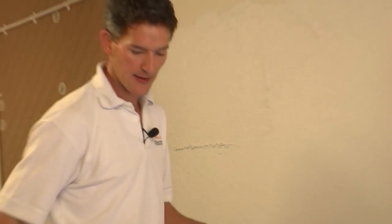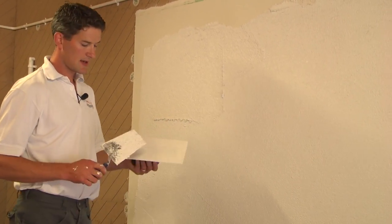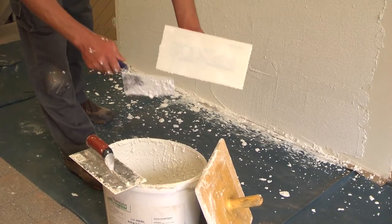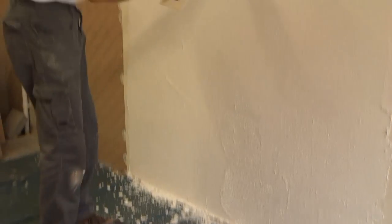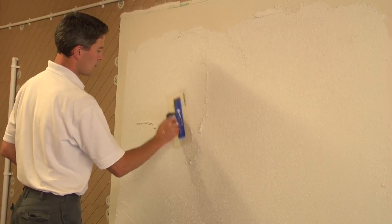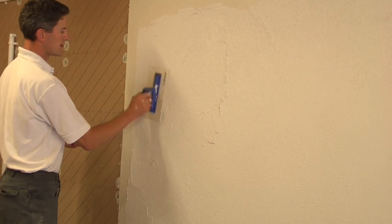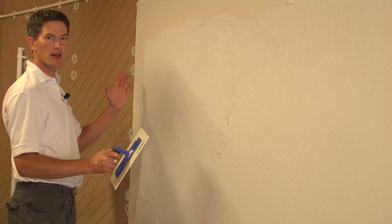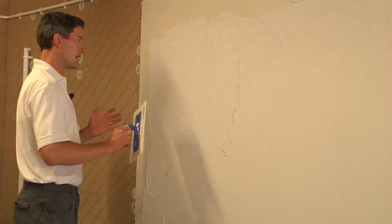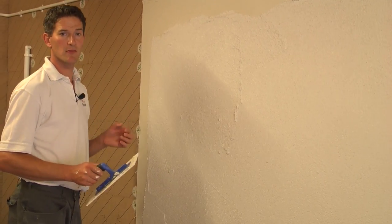You can see we're rubbing it up like that — that's basically all you do. The trowel is pushing off the excess material around the edges, and we simply scrape it down and keep it as clean as we can. Then gently go over it again and work your way along. With corners, work towards the corner and sort of down and around, and you'll get the grit going right up to the corner. If that was the corner of a window reveal, keep working towards it to get grit right to the edge. If you work in the opposite direction, pulling the grit away, you'll end up with a bare corner.